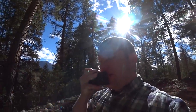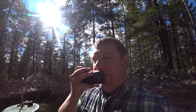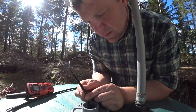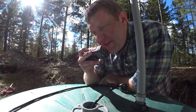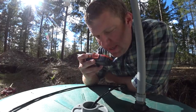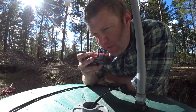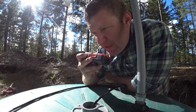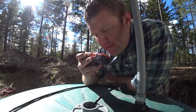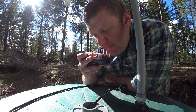The monitor is set up — can you tell me if there's any kind of reading in the garage and what the bars are on the receiver? You're telling me this thing can actually get a reading in the garage? I'm really happy with that. The instrument is a little inaccurate overall because we haven't filled the tanks up yet — it's measuring basically the entire length of the cable because it doesn't know the high limit. We'll fill the cisterns the rest of the way today and then it'll know what the high limit is. This is good.